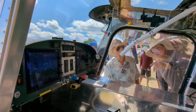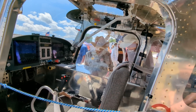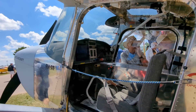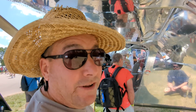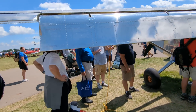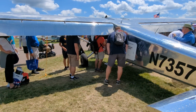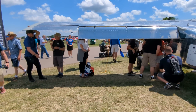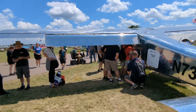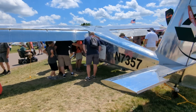Typical engine controls right there, and here's the flap mechanism to manually raise and lower your flaps. It looks like electric trim as well. Talking to the Van's rep, they don't want to go with leading-edge devices or additional high-lift devices — they're expecting enough performance from this wing — and they want to maintain reasonable forward visibility for reduced liability. That's a quick look at the RV-15, the hottest thing at Oshkosh 2022. They're lined up around the pattern to see it, and they expect to start selling kits in about a year once prototype testing is complete. The price for the basic airframe kit should be somewhere around the $50,000 range in today's dollars.